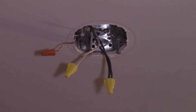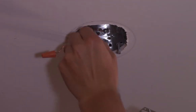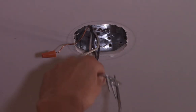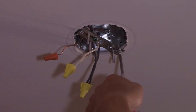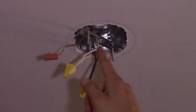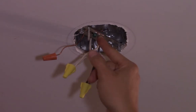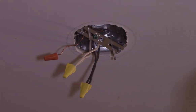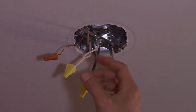For mine I've got two sets, so let's go ahead and put this new one up. You essentially want this thing to fit right here, so we'll pop these screws off and put it right back in place. What would make life a lot easier is if you took this plate and screwed it tight to the electrical box, but what happens is these screws become too short to grab through the light fixture. So what I do is just leave it a little loose, and once you get the screws in it'll tighten it all together.